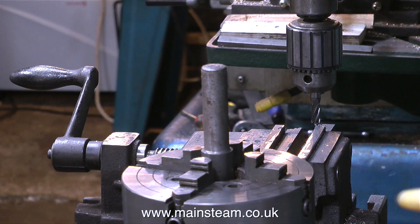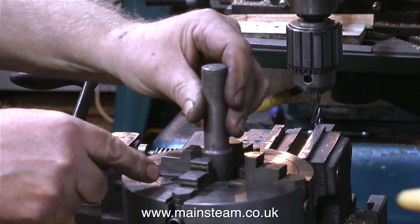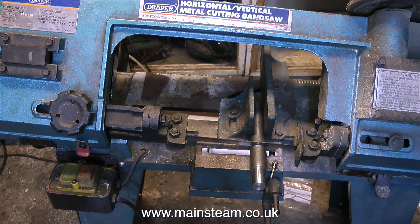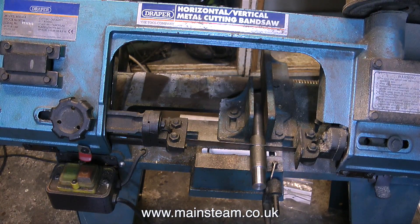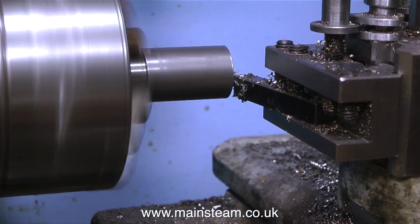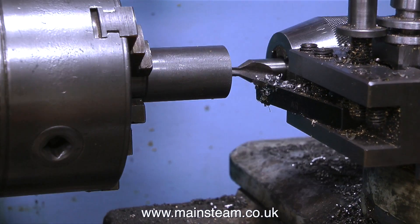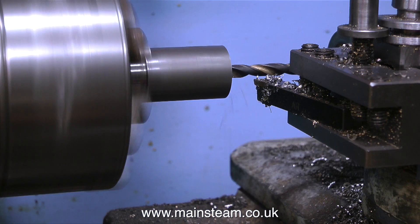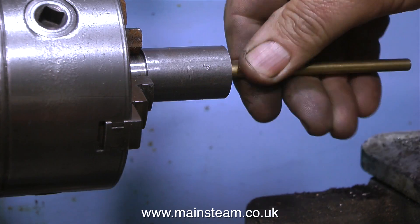Removing the piece of metal from the chuck, it fits perfectly in the hole in the mounting for the four-jaw chuck. All I have to do now is hold my needle file against it and rotate it, and then it's over to the bandsaw where I cut it to length. And for the viewer who wrote in asking to see a close-up of the bandsaw, well here it is. Once the piece of metal bar is cut to length, it's back into the lathe just to face the end to tidy it up, and of course drill the quarter-inch diameter hole in it. As usual this starts off with a centre drill, followed by a quarter-inch twist drill. I don't need to use a reamer for this — the twist drill will be fine — and I verify the size with a piece of brass rod.